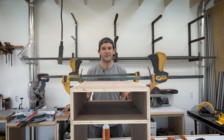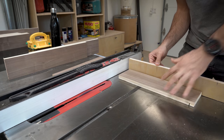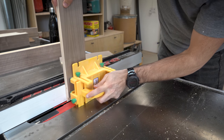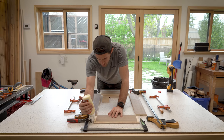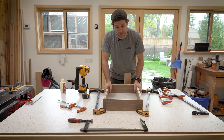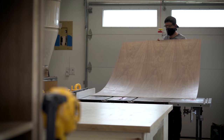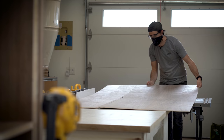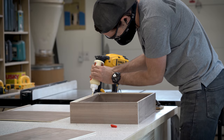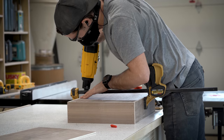While that dried, we made some drawers. I started cutting leftover plywood into four-inch strips — these pieces would be the backs, fronts, and sides of my drawers. Similar to the boxes, I cut rabbets for assembly as well as rabbets along the bottom to hold the drawer bottoms in place. Assembly was pretty straightforward: glue it, make sure it's square, nail it, and you're done. I assembled six drawers total, then cut quarter-inch plywood for the drawer bottoms. By cutting them so precisely I was able to pressure-fit them in and force out any minor variations in squareness.